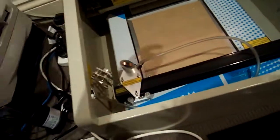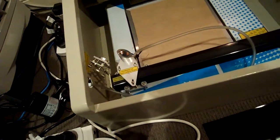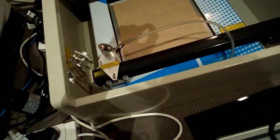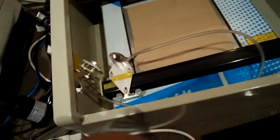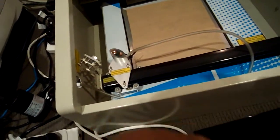Meanwhile, I've got the air hooked up, so it's air assisted. Basically what this does is pumps 800 litres of air a minute onto the base, and so it'll cut and the air's just going to help it blow through. It also helps make sure that the lens stays clean whilst cutting, so I don't have to clean the lens every three days, which is what is recommended.